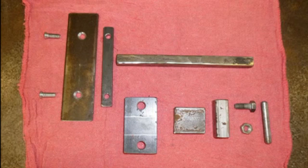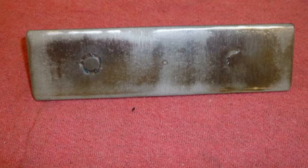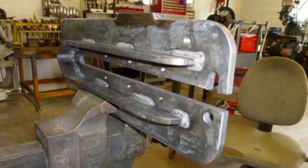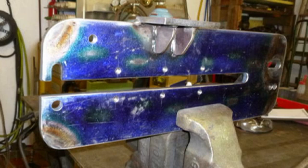These are all the parts necessary for the adjustable fence. All of these will be welded to the piece on the bottom with the two holes, which is the spreader. This is the whole assembly welded together. This is the removable faceplate for the fence, and you'll see later on why this piece has to be removable. The next thing was to weld the support onto the main frame, and you can see how it leaves room on the top and bottom for the six holes for the spreader.